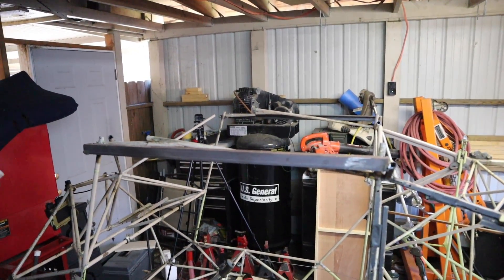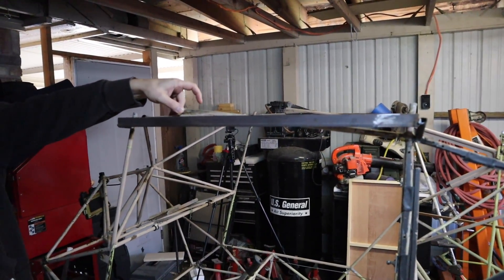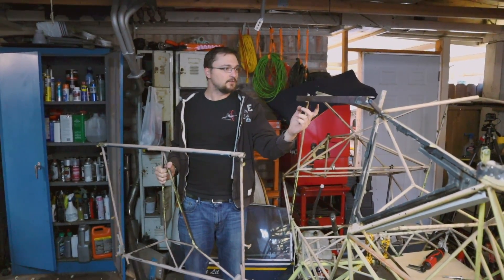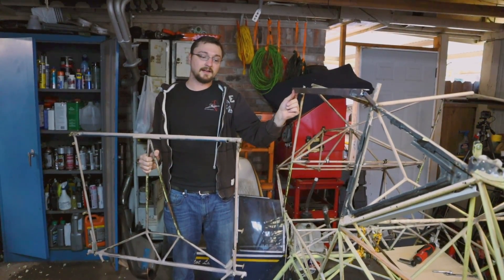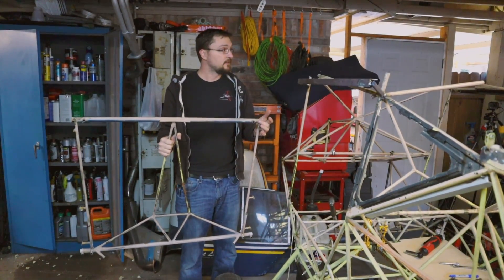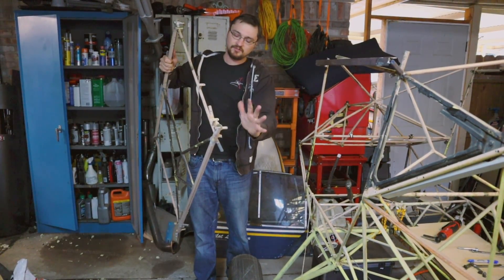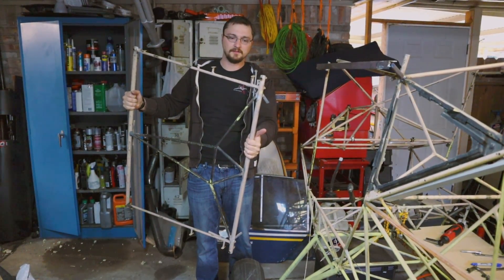Folks, don't do this if you paid a lot of money for your airplane. We bought this at salvage prices, and this one will never be the same. Maybe it'll be better. With the top cut loose, we're ready to start moving up - or I should say we're almost ready. One thing we didn't do before the cut that I thought about and then forgot is we actually need a piece of metal going from this guy right here - which you can see the wobble in - over to the other one. That wobble is the reason. This needs to be square. Now, nice thing is it's an oops, but it's not a big oops. We have our original piece here that establishes our width, so we can bolt that back into place. But before we do that, we've got a little bit of cleanup to do. All of this tubing that we've now cut off needs to be cleaned up, brought back in, and surface prepped to get it ready to add material and weld onto. This needs to be bare steel, obviously, before we can weld.